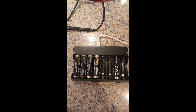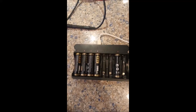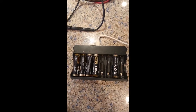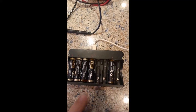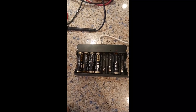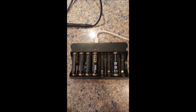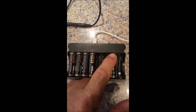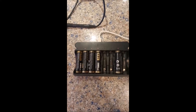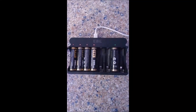When it's fully charged you'll see it reach a minimum of 1.6 volts, possibly higher. This system works — it's something I kind of discovered by accident. Since these batteries are approximately two dollars each, you really don't want to throw them away or hassle with a return from EBL. What I do recommend is: once you have a battery that falls under this condition, make some kind of mark or notation on it and see if it keeps happening. If it does every time, that particular battery might be time to send back.